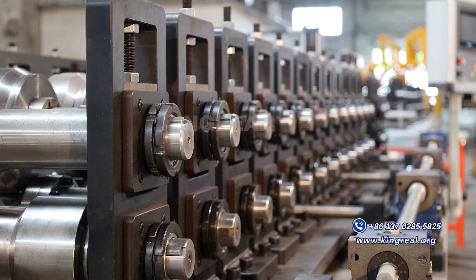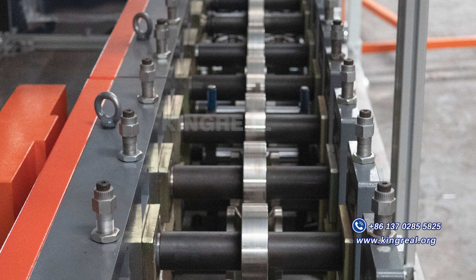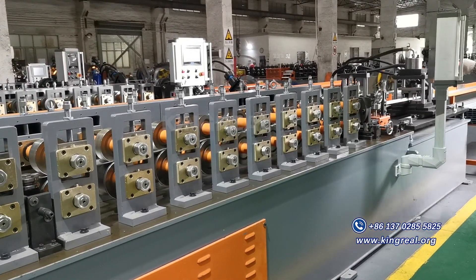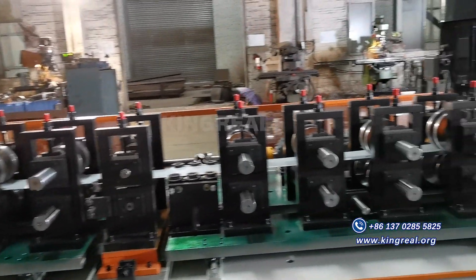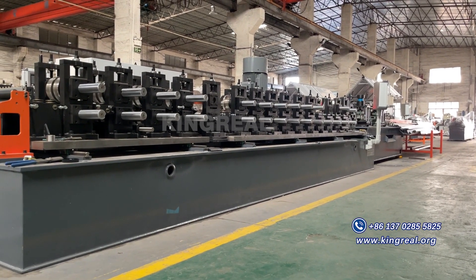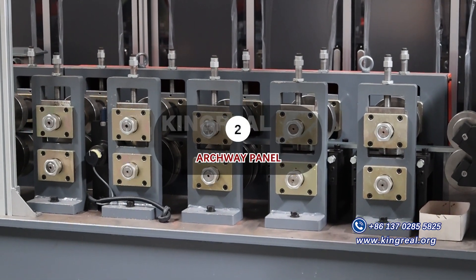What materials does the roll forming machine consist of? The machine frame is welded by steel panel to a one-piece structure. A 20mm thickness panel is placed on the frame after fine processing by the planamiller. This ensures the accuracy of the basic size and increases machine strength to reduce deformation influence. The archway panel features an independent structure with surface blackening process.